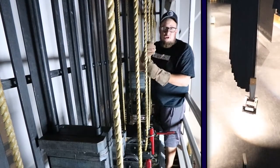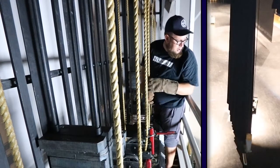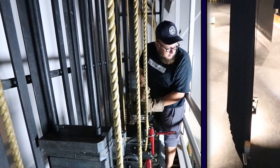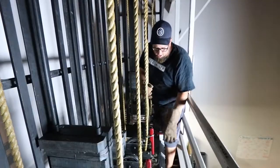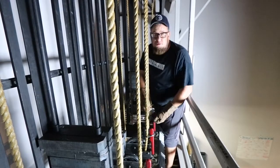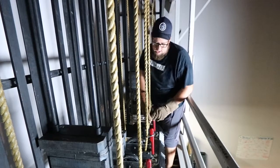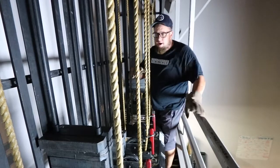As the curtain is going down, make sure nobody's underneath it while you're lowering it. If you have somebody else there to help, have them tell you when to stop. If you don't, go until you see the curtain squish just a little bit at the bottom, then go back up just a little bit until it unsquishes. Pull the red lever back up, lock it, and you're done.